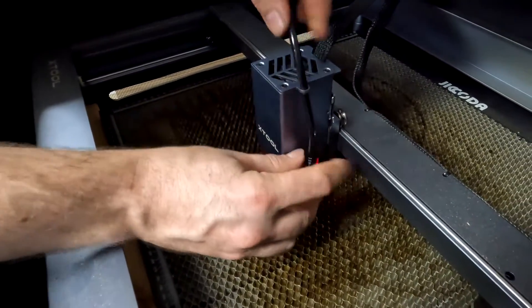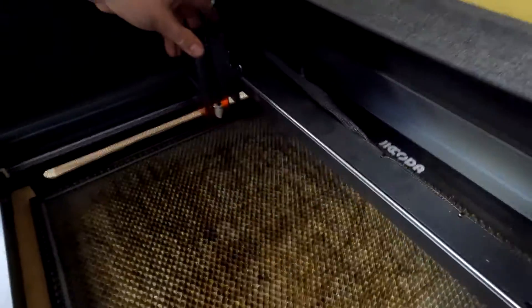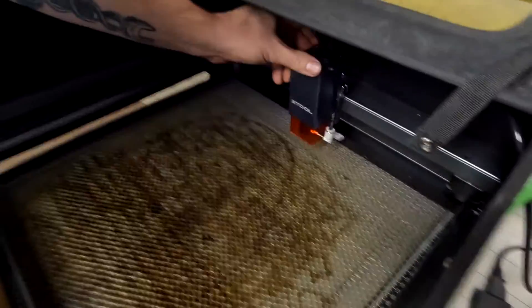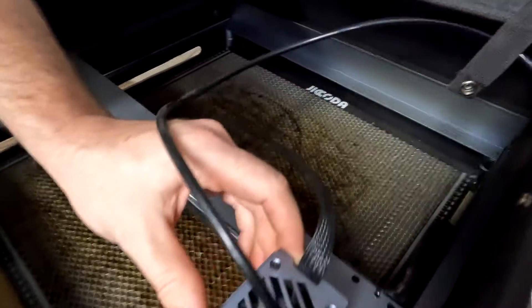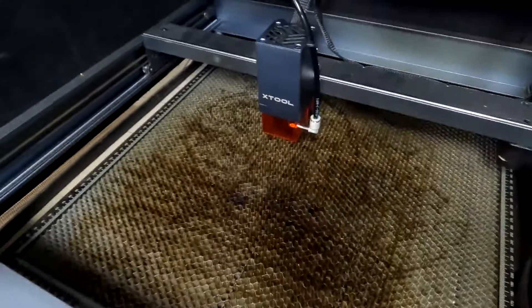The last thing we want to do is make sure we have free play all the way across our laser. Check your cables — make sure the cables reach all the way to the side, all the way to the back. Basically just do a square around your unit and make sure there's nothing binding and nothing catching. That way you don't start a project and find out your wire is too short and cause some damage. And that's all there is to cleaning the X-Tool Laser D1. Hope you enjoyed the video — please click on like and subscribe.